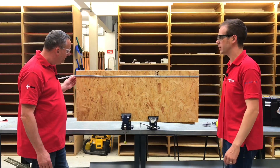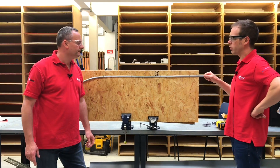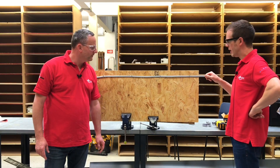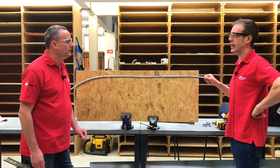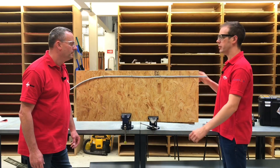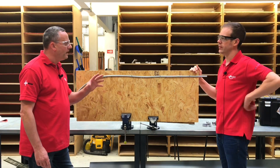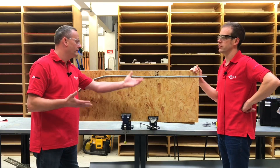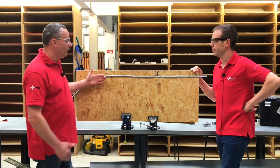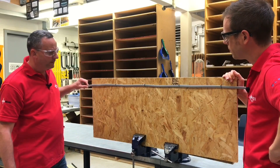That was quick — four supports in rapid time. However, there's something a little different to get used to. When I used to clip cables, I always liked them to be quite firmly in place so they wouldn't slide through a run of clips. These staples aren't designed to hold the cable in that way — they're designed to support the cable so it won't fall down, but it may move. If you laid a cable on a plasterboard ceiling in a roof space, you wouldn't be clipping those cables either — and likewise here, we've held it in place by supporting it, not stopping it moving.